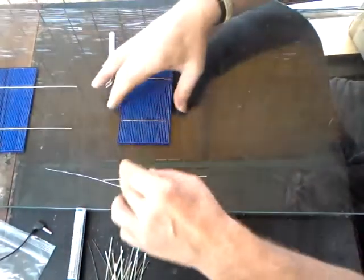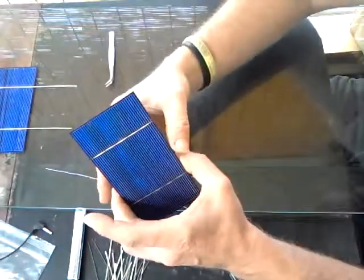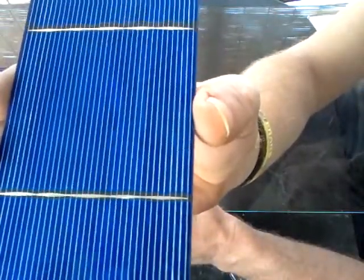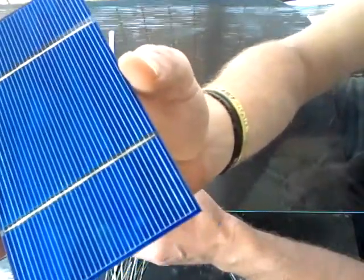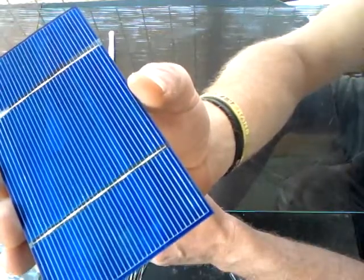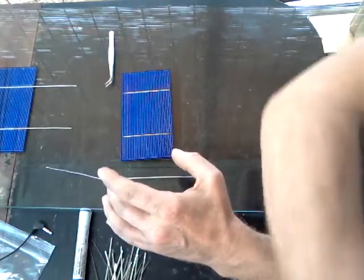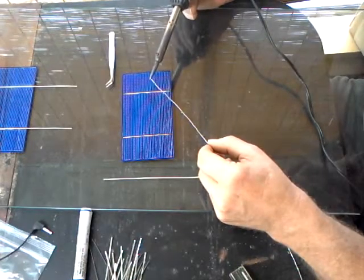This gives the panel a little additional solder for the wires to stick to. You want the solder to be nice and shiny. If it looks whitish or grayish, or has a lumpy texture, that's called a cold solder joint — it's going to impede the flow of electricity or stop it entirely.